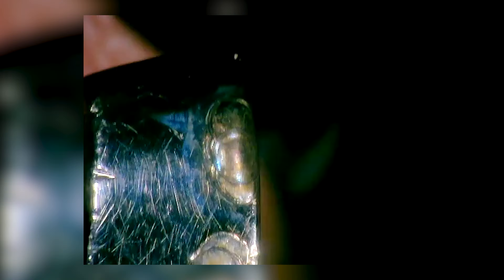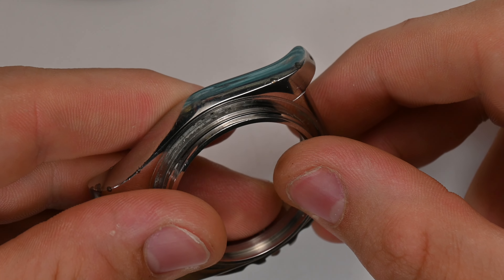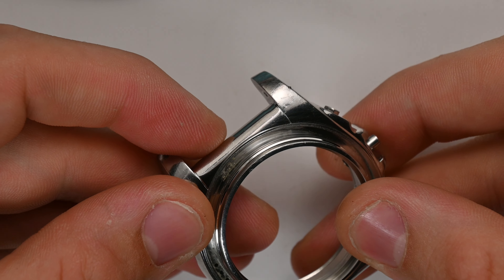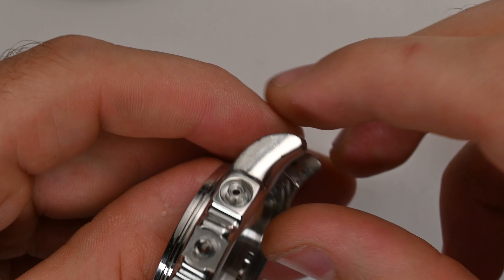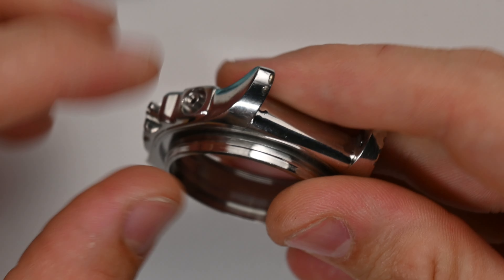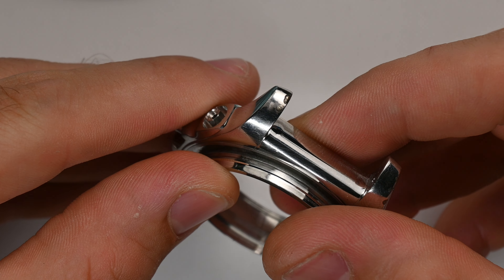Here we can see how the laser pass creates an effect on the surface. We can see the surface texture it produces. This rough aspect is completely intentional — it's the only way I will be able to polish it without having to remove excess material to equalize the whole. The fact of filling the scratch with material first allows for proper leveling.